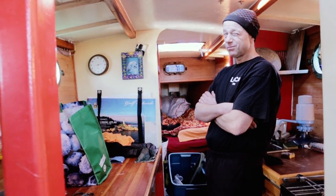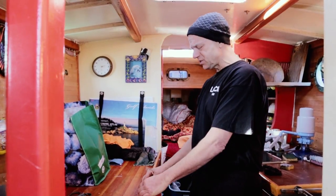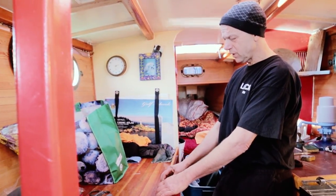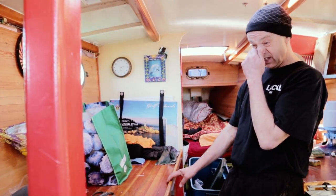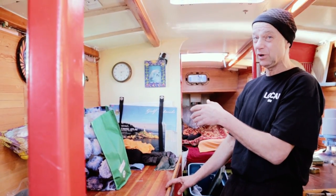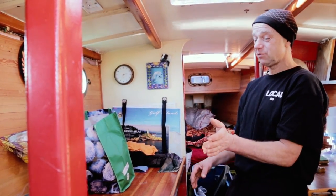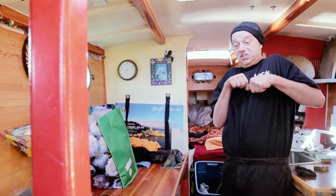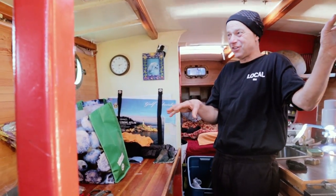Anyway, I think it's something I should probably talk to an actual sail planner about. Yeah, I think so. And there's something about balancing your rig in heavy weather too, when you're out in the ocean. Most boats, unless they're really poorly rigged, have weather helm, not lee helm, right? Yeah. Is it lee helm? It's not weather helm, it's lee helm. But after a while, if you can't get that mizzen sail involved and it's really heavy, you can't hold the tiller, but with a little bit of mizzen, the thing's balanced now.